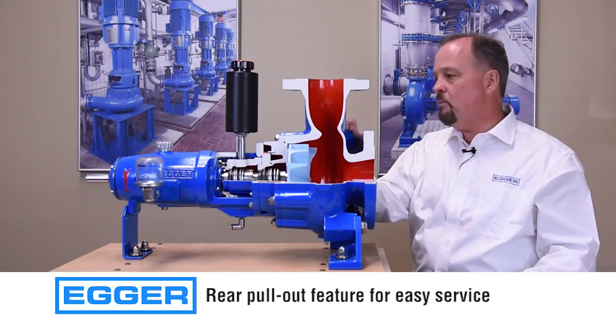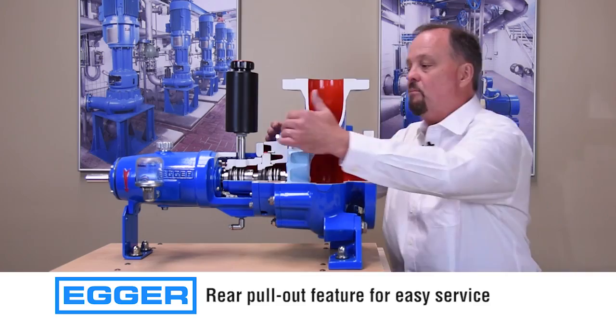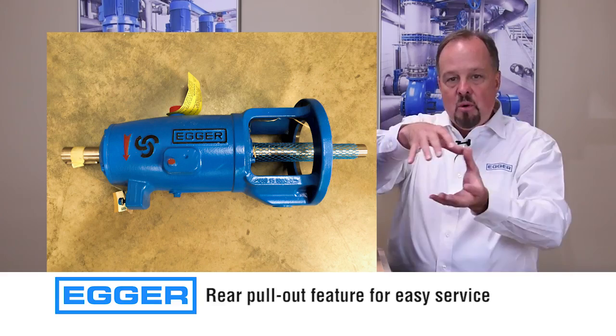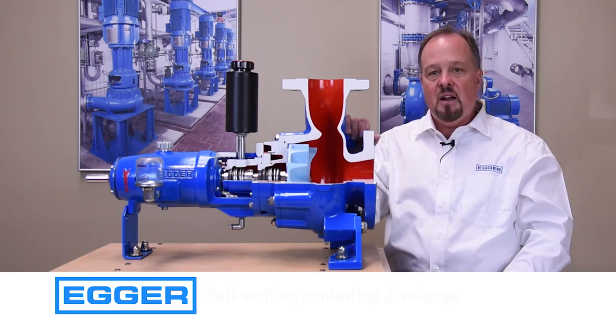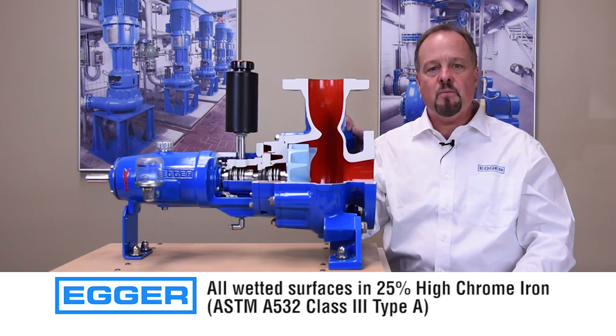Simply by removing the coupling guard and coupling, unbolting the foot, and removing the bolts from the back plate, you can very easily, quickly remove the rotating assembly for service. Lastly, the pump's centerline discharge is self-venting to ensure our pump cannot become airbound. Our grit pump design is simply better, and we will stand behind our claims.